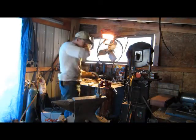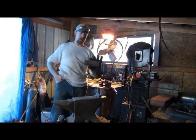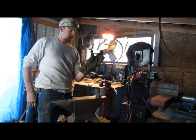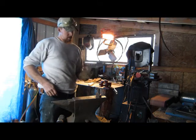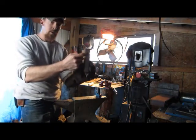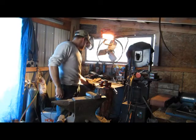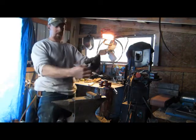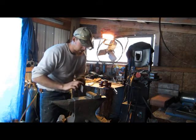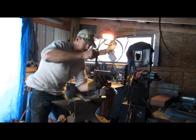Alright guys, I'll tell you what I got done. What I've done is I've taken the track — the top part of the track that the train runs on — and I cut it down and smoothed off where I cut it. I drilled a hole in there — hopefully you can see that — in through here, that'll give me a starting point. Then I just took a piece of flat steel, ground it down to a point, and hardened it a little. What I'll do first is take that and drive my chisel, start driving it down through.